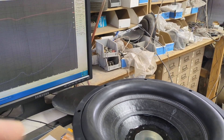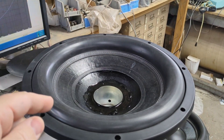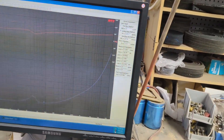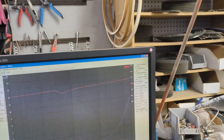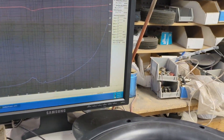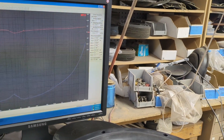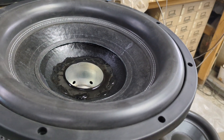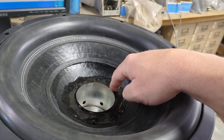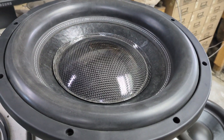FS was like 39 — too high. Added a little bit of mass and a nice load of epoxy, and let's go ahead and do a sweep on it again, see where we're at. We're at 31, 32, and that should be fine. I still got to put an inner cap on it, and then we're going to do the fancy carbon fiber as the outer cap.